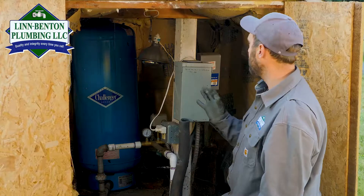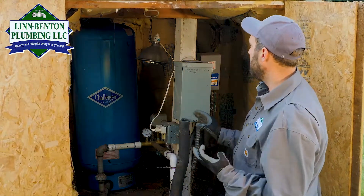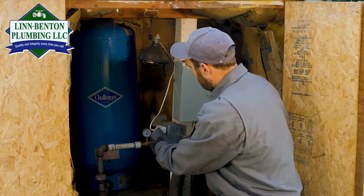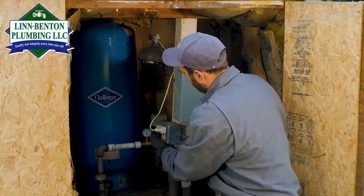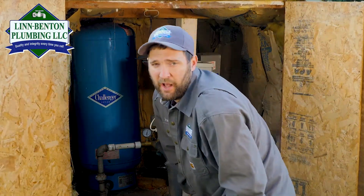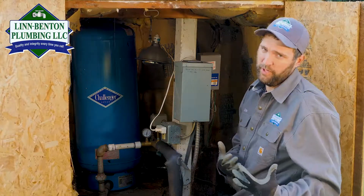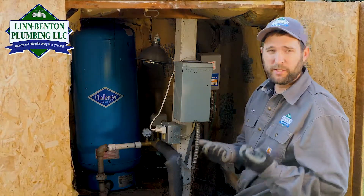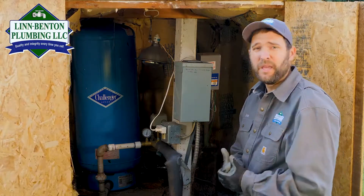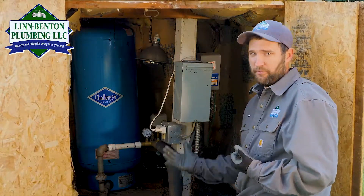We want to check the insulation in the pump house and make sure it's good. This pump house could use some more insulation on the doors if we really wanted to make it weather tight. Another thing we can do to keep pump house components from freezing is to keep water running in the house. Unless it gets really super cold, water isn't going to freeze when it's moving. Keeping a really slow drip on the faucet — maybe a drip every 10 to 30 seconds — is going to be enough movement in the water to keep the pump house components from freezing.